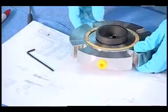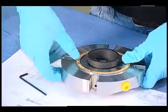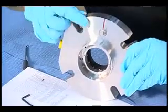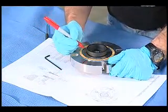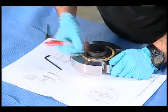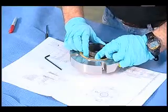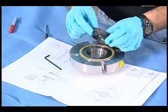I'll make sure when I take out the inboard seal springs I put them in a different bag. One of the problems you're going to come across in indexing a seal is that it's fairly easy to get a mark to stay on silicon carbide until you clean it. For indexing a carbon, I'll find my index mark on the flange, align it with the fold in my drawing, and go ahead and put a mark on this side of the flange and one on the gasket as well. I use my red sharpie — that's my designated color here in Charlotte. That mark's probably not going to stay there because carbon is very absorbent, and once you clean a carbon anything on the surface is going to be gone. But once I have it marked I can also mark the o-ring again using the pinch method.